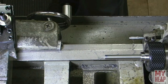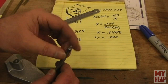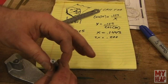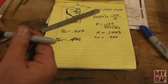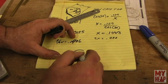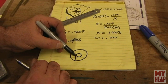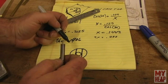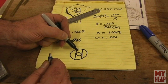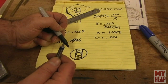This can come out of the lathe now. What we're making is what Curly calls a slot drill with a pen, or a pen drill. I need to put some cutting edges on this. What I want to do is take the edges off on each side to end up with a flat on each side, then file these back to form two cutting edges. There are a couple of ways to do this — you could file it by hand, grind it, or sand it. I'm going to grind these down.